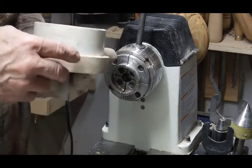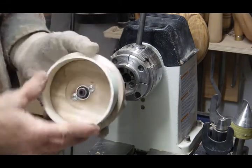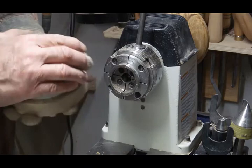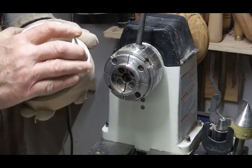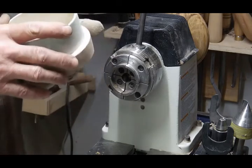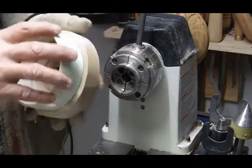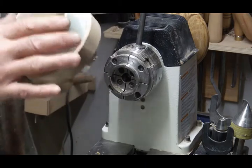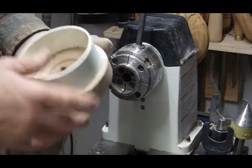Okay, see, it's squishing out. Give it a little rotation to make sure it's sealing everywhere. Don't wipe off the excess, leave it there. It adds extra strength anyhow, and that way you don't end up with a void that will leak vacuum.